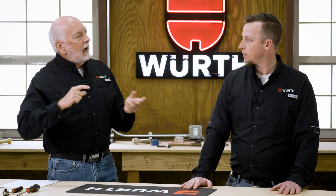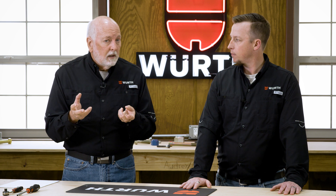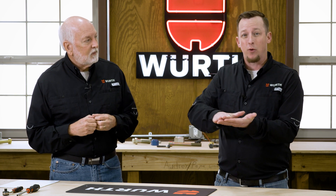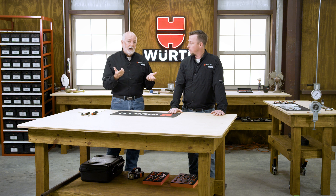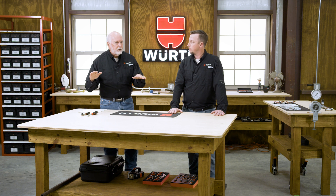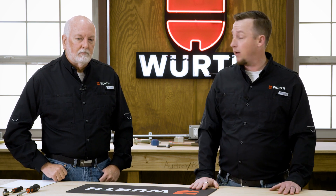Think about this: what if you paint your surface and then assemble? Paint can act as a lubricant, or it can actually increase friction as it reacts with the fastener surface. The same is true for the surface texture of an assembly — a machined surface with a rougher texture changes the bearing surface friction. Rust preventatives are another factor: if the material comes in with even a slight oil sheen, that's a different frictional factor. Thread lockers are another example — liquids act as a lubricant initially but harden over time and work against you, while pre-applied thread lockers add a prevailing torque element with additional friction.